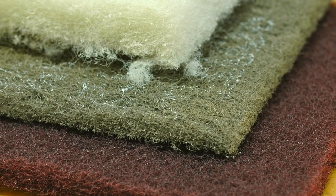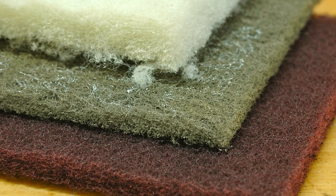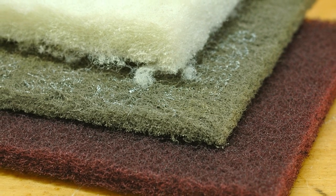Follow up with some kind of a non-woven rubbing pad — I use stuff from 3M and it works really well, especially on your project because there are all kinds of round surfaces. Sandpaper maybe for the flatter surfaces, but nothing too coarse. I wouldn't use anything more than 180 grit; if that proves too gentle then try 150, but I wouldn't go any coarser than that. That might be fine for the seat, maybe the back, flattish areas like that. The rubbing pads are going to be much better for getting right back down to a clean surface that still has the patina on it.